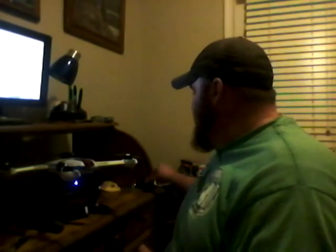So we take that, and now you will need to download an FTDI driver for this. The Blade 350 QX GUI has a driver that you can download, because I run Windows XP, so you have to get the driver. Okay, so anyway, we're going to plug that in. I'm actually using the original Blade multi-rotor update utility, which came out when the AP combo came out, and you could update your software to version 2. So we've got COM7, which on mine is the only one selected because I unplugged all my other USB devices.